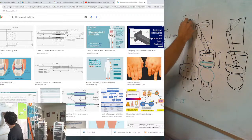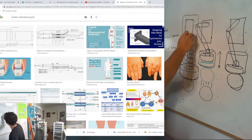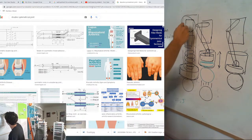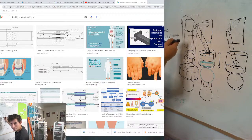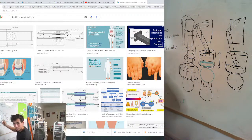We can do it on a CAM system. So this rod could be on a spring here, and then it can just be a simple CAM. Something like that. As the CAM comes around, it pushes the rod down, and then the CAM comes back up and it pulls the rod back up. So I like that idea. Neptune coming in hot.